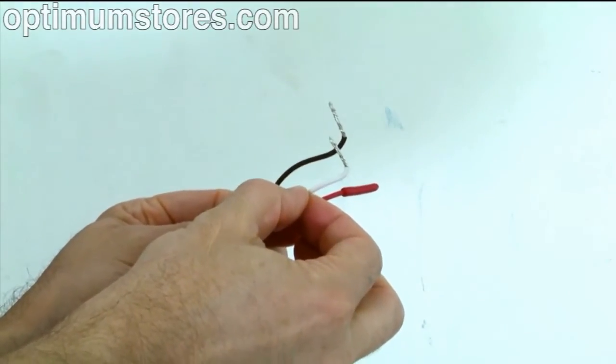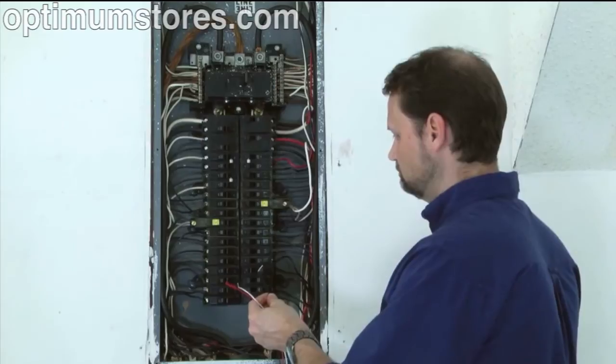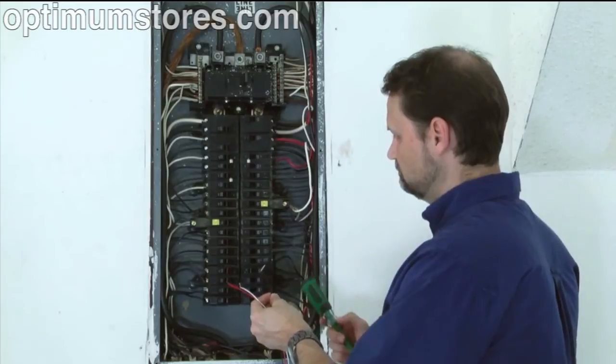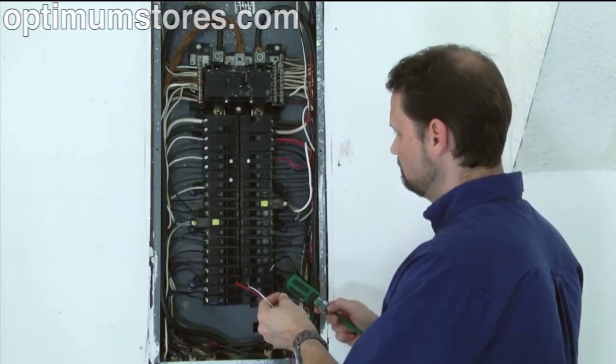Note that the black and white wires will be connected to the breaker panel. When connecting the black wire, the wire must be connected to the circuit breaker supplying power to the gateway, or a circuit breaker that is on the same phase or leg as the gateway circuit, which is the breaker powering the location where you will be plugging the gateway in within the home.